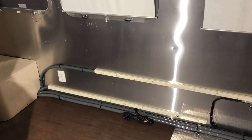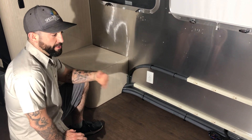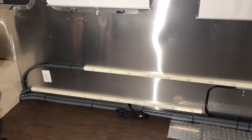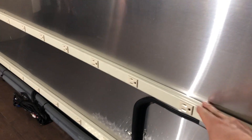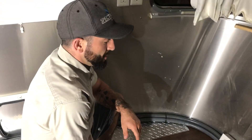I'm seeing lots of very clean wiring. This particular customer wanted a lot of outlets so he could plug in a lot of musical equipment, and he wanted 20-amp capability for his outlets, so we ran individual lines for each of these outlet strips. Each of them are rated for 20 amps. He also wanted a 20-amp outlet isolated for his washer and dryer that's going to be in here.